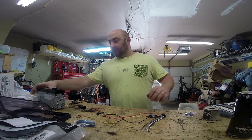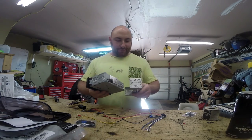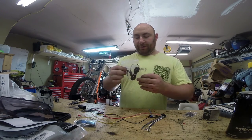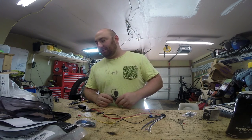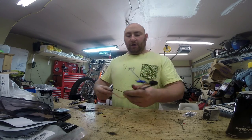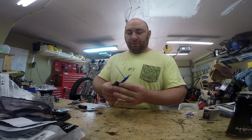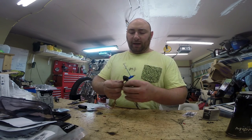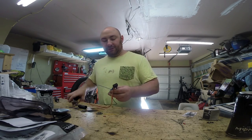Next thing we've got to tackle on this boat is installing our new Bluetooth head unit. These things get smaller and better every single year. In addition to our head unit, it comes with a microphone that we're going to install. I don't really know how well Bluetooth caller stuff is going to work on a boat, but it's there — might as well install it, same amount of work. It comes with a nice little remote and a harness. I've already taken the opportunity to tie up the wires for steering wheel controls and the external line that goes to an amplifier. I'm not going to be running a sub, but I can always cut that off if I need to later.